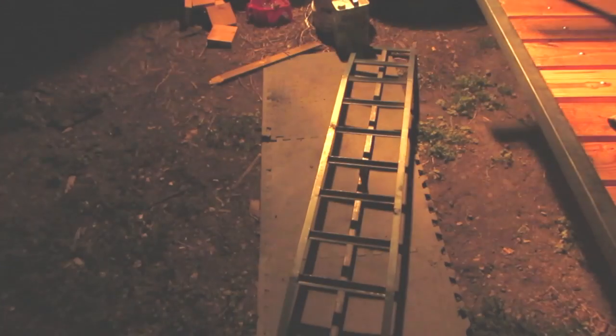Yeah, I might have to put some more cross beams in it. Here, let me take this down and show you guys how I did this. Alright, well, sorry about all the lack of light, but this is all the light I've got. I put 12 angle iron pieces, crossbars in there. I took a piece of 1 inch by 1 inch, connected the ends, and then I've got a bracing in the middle here. I might add some extra ones here, I don't know. So far when I stand on this thing, it doesn't flex at all, so I think that's all I'm really going to need to do with this.